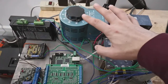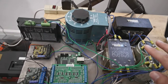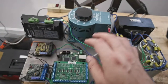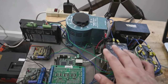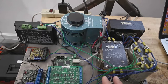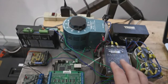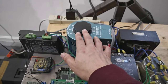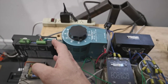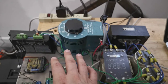This right here is the power supply for the low voltage to supply the stepper components. This right here is for the spindle. The spindle is a normal routing spindle which I have changed into a shunt-wound motor. I now need two sources of voltage, and these are them. With this I can change the RPMs on the motor from very low to very high, which basically maintains the torque of the spindle even at very low RPMs.